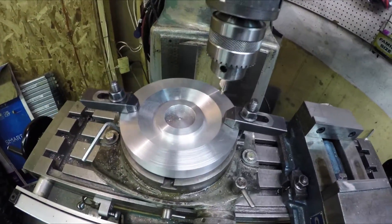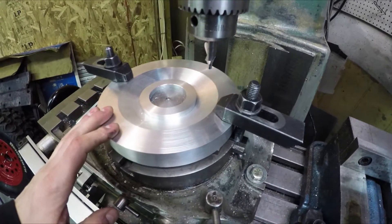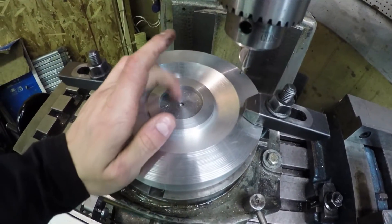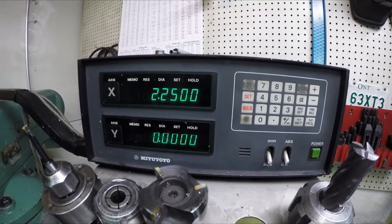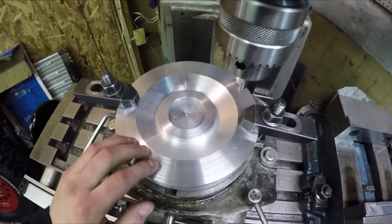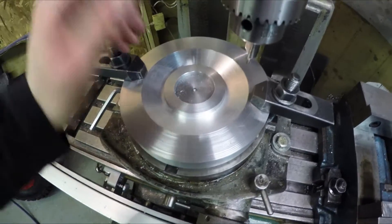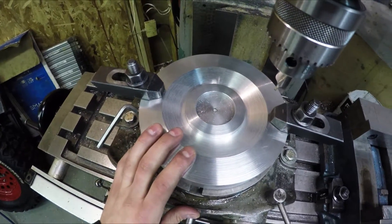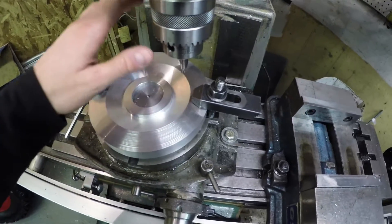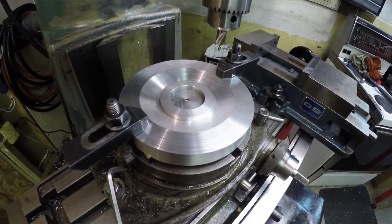I finally got this thing in the rotary table on the mill and it just barely fits - I have a clamp; it's not the best but it's good enough to hold it. It's already zeroed off and I've moved it out to the correct radius. It's a four-and-a-half inch bolt circle, five bolts, so I'm out two and a quarter inches. I'm going to drill a hole every 72 degrees, then countersink it so the nut presses in for clearance. Then I'll flip it over and drill the other bolt pattern for the Razor, which is a 4-bolt on a 156 millimeter circle, then press the studs in and it'll be done.